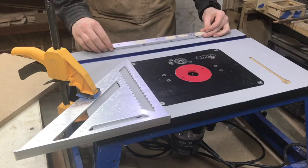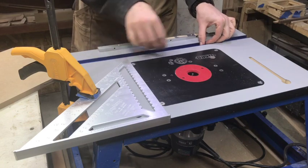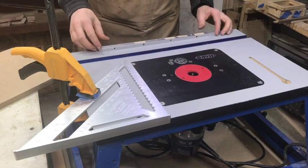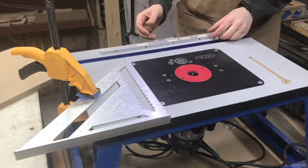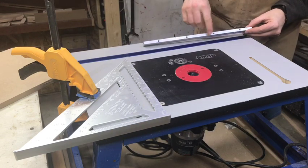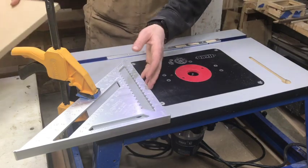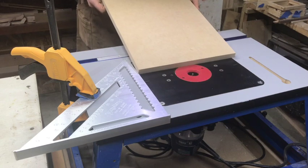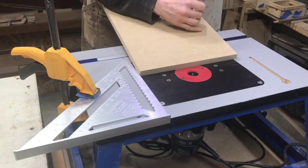We're now going to be attaching the miter bar to the base of our jig, and we're going to make sure we have 3 dimes. Some T-Track takes nickels, this one doesn't, dimes fit better, and we're going to evenly space them about the size of our bar. Now we're going to want to make sure that since I'm pulling, I want a little more of this bar this way, so that as I go forward I never get it coming out more than where these spacers are. So I'm going to leave it probably here, and you're going to clamp down to where you want your jig to sit. Now I know that I want mine to be hitting right about in the middle here, and then I will then route forward so that I can go back and forward.